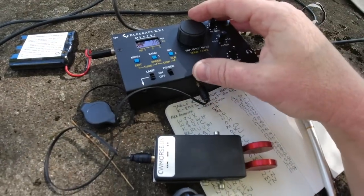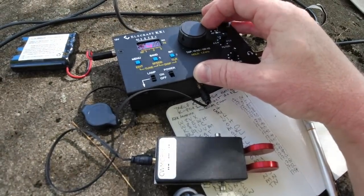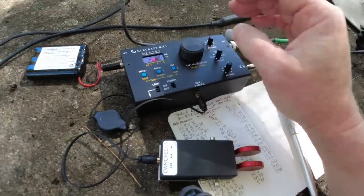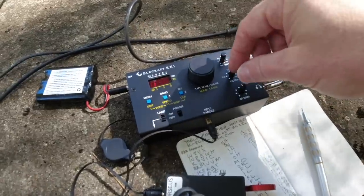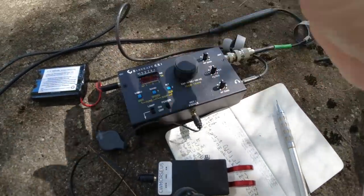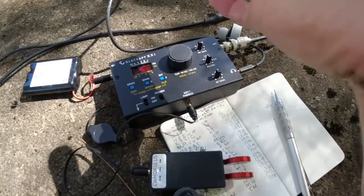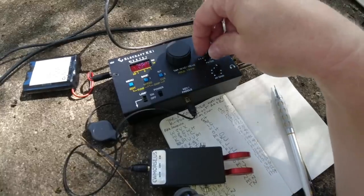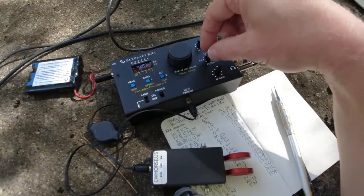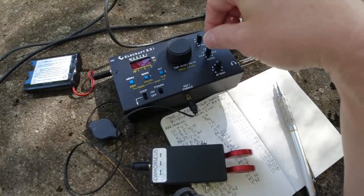Yep, okay, so, hey, for kicks, let's just go ahead and do it. Let me find a spot here on the dial. Now, I will say another thing about this. The KX1 doesn't have a surgical filter system like the KX3, the K2, especially something like the IC-705. It doesn't have that kind of filtering. It's got a little variable filter. It's got crystal... So you can hear, it's probably about 2.2 kilohertz, 2.4.